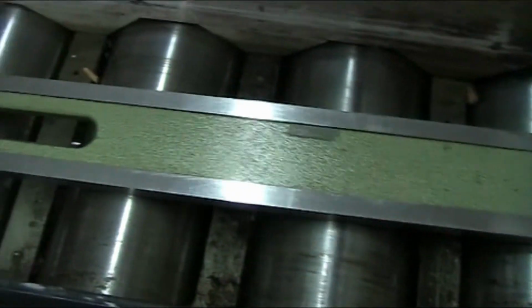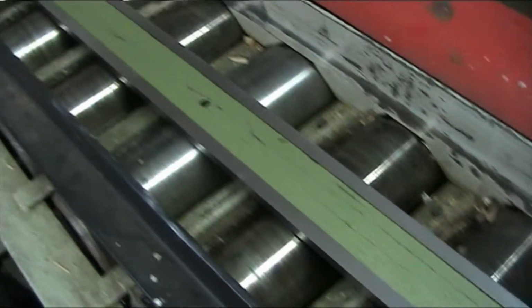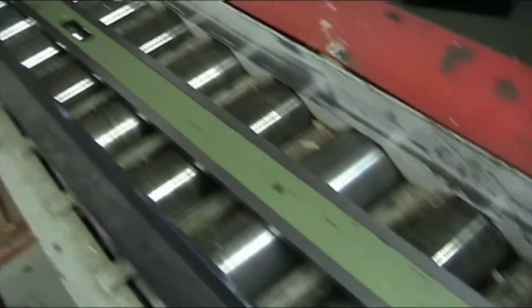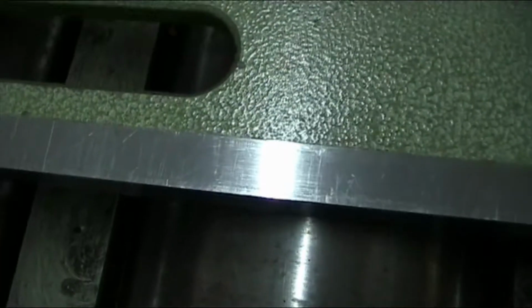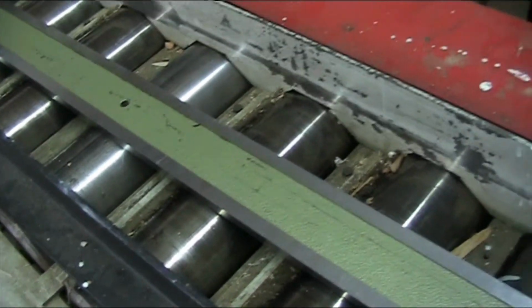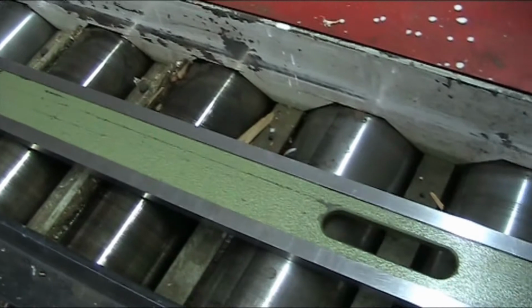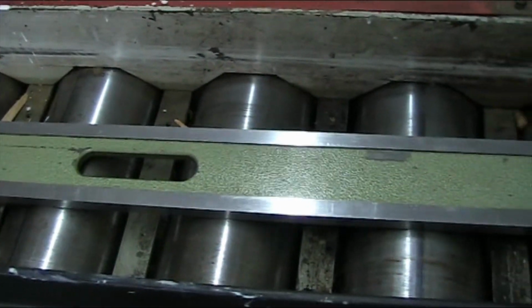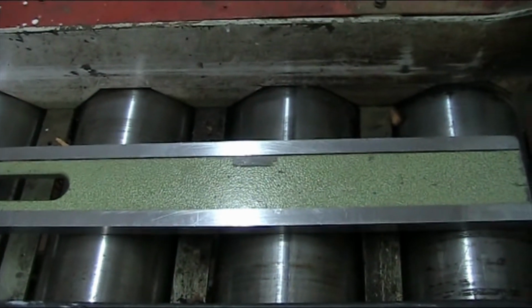So here's the ruler that we'll be using today. As you can see, it's a nice steel ruler, 2 meters long, almost 7 feet. And it does have a fairly nice crisp edge, and this is critical for this operation because we have to have visible contact between the guide fence and the ruler. I did try it with a long extruded aluminum level. Unfortunately, those have rounded edges, and those are not suitable for this purpose.